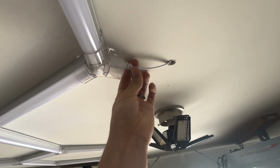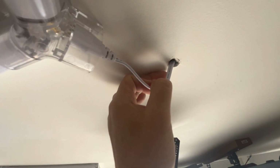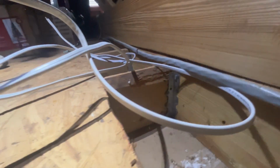All right, so we have the pigtail end that's attached to the hexagon lights, and we have the extension threaded through, and then here's part of it just dangling out of the top of the attic. And now, let me show you what we got going on in the attic. All right, so it's a little dark up here because we had to turn the light off because we're gonna be using the switch to the attic light to power this. So basically what we have is a Christmas tree. And then we have the wire coming up underneath the sheetrock and from the floor, and then we're going to thread it up this little post to that light fixture right there, where we're going to tap into the power to be able to turn on those hexagon lights.